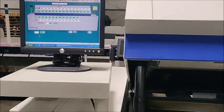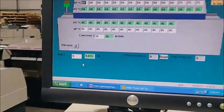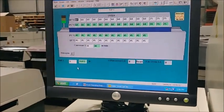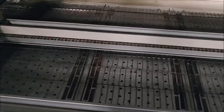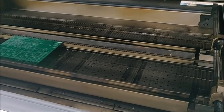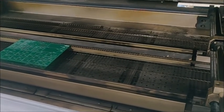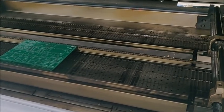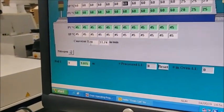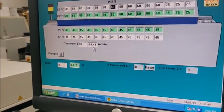Now the conveyor — right now we have it running at 38 inches a minute. We can lower that to show you. I'm going to slow it down to 20 inches per minute. We do that just by changing the number in the box on the screen. We change this one to 20 where the mouse cursor is and you can see now it's recalibrating itself to meet the new set point.